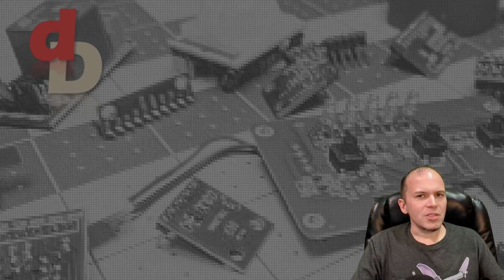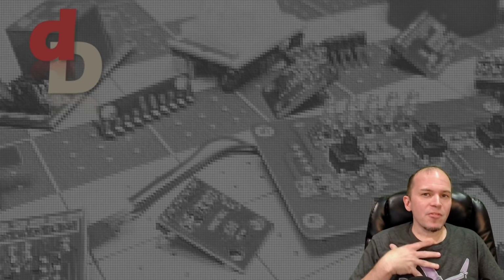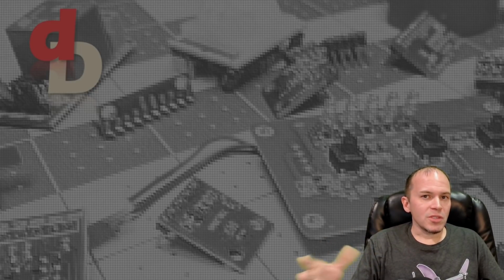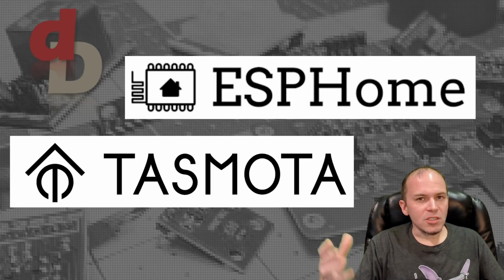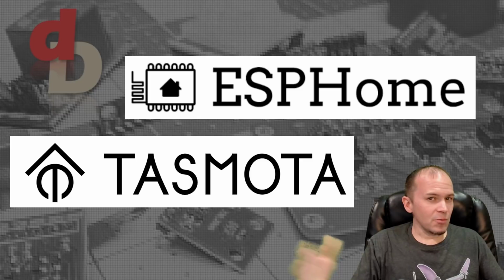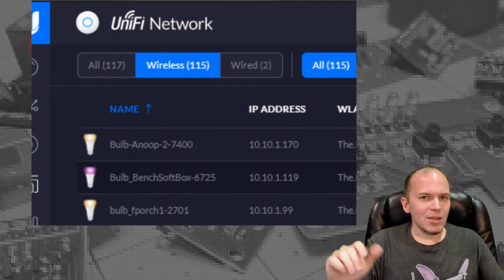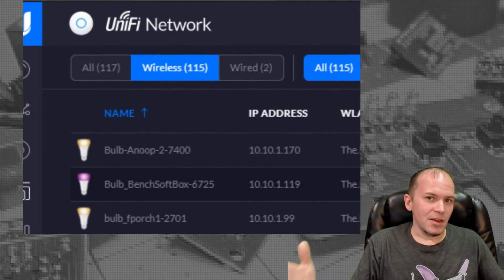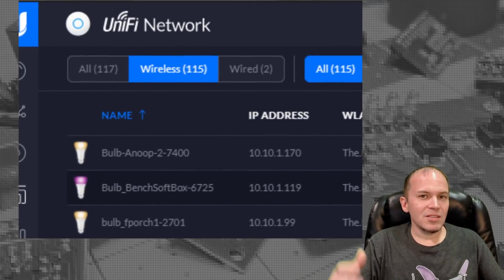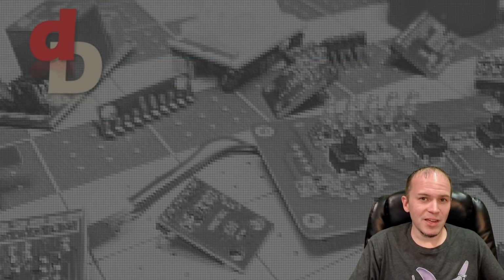Oh! So I get this question asked all the time. What smart switches do I pick, and why do I need them, and what do I use? I prefer to use smart switches that are on the Wi-Fi, and they are flashed with third-party firmware, such as Tasmota and ESPHome. And well, wait, is that going to clog up my network? No. Don't let the naysayers tell you otherwise. I have a ton of smart switches and smart devices on my network, and have zero issues, because these switches aren't watching Netflix. They're just sending on and off statuses back and forth.